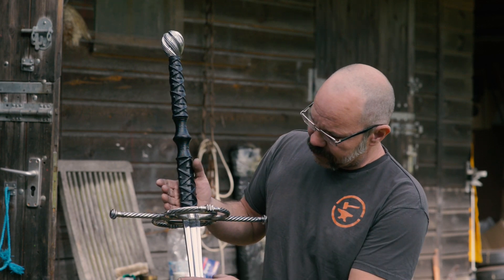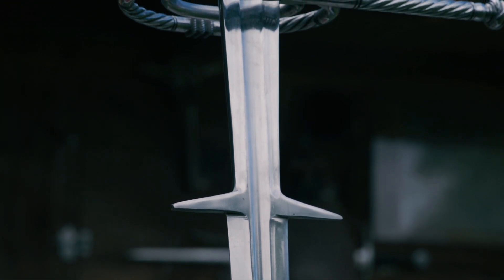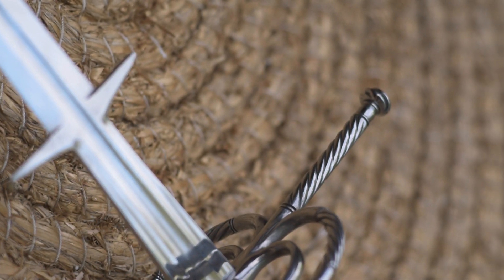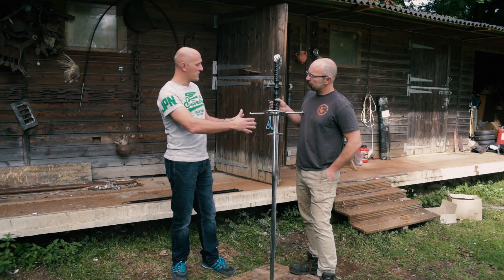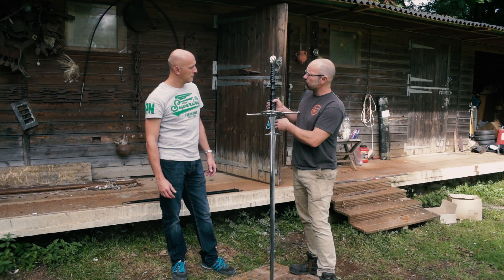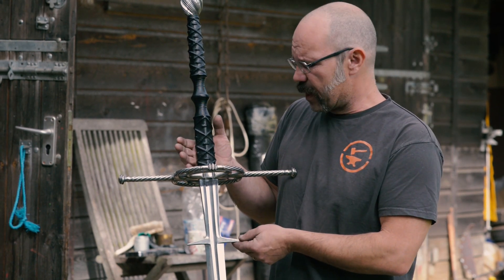Making the blade was okay. These lugs — I started with a wider bit of steel and I pinched and forged them out. So you didn't cut that shape out of the slab? No, they were pulled out, and then really it's just making a blade as you always would — just a bit of a monster. I imagine that's how a lot of the original ones were made, forging them with grinding at later stages, because it would be very wasteful in material to start with a large piece and cut it out. You could chisel it out — cold chisel or hot chisel — but just putting a cut down, folding it out, and reforging is a faster way.